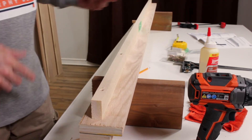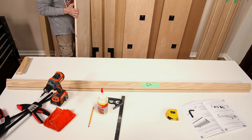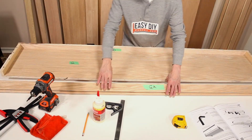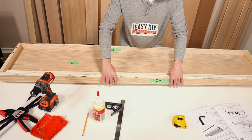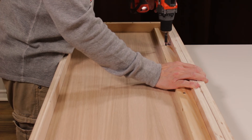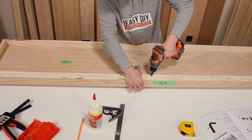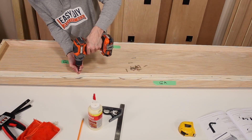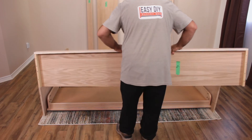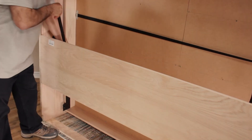Remove the wood clamps. The construction of the cabinet top front stopper is now complete. The two components can be attached together at this time using 4 to 6 one-and-a-quarter inch wood screws. However, the two parts will have to be separated later during the assembly of the Murphy Bed. Separating these two components is vital for the proper assembly of the Murphy Bed and the installation of the Easy Lift Piston System.